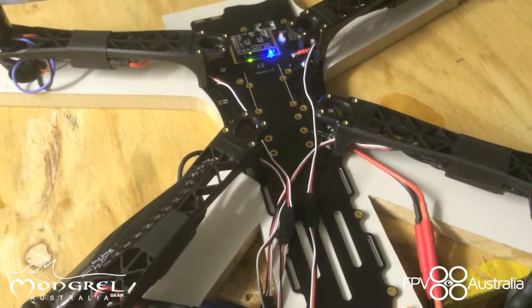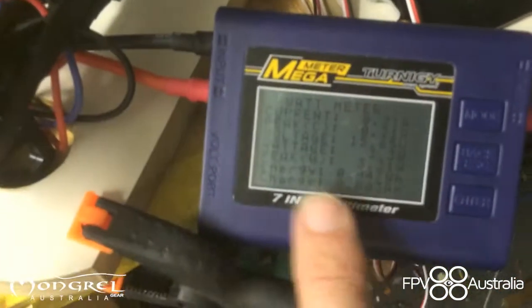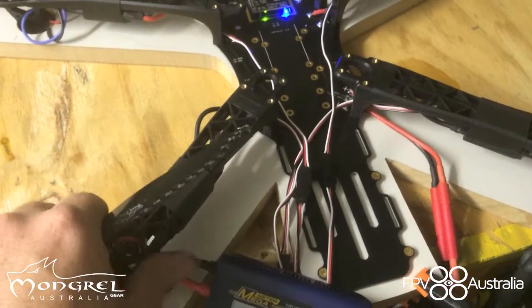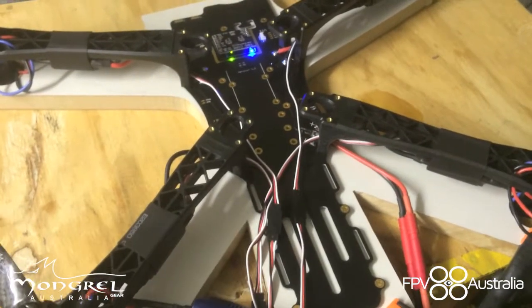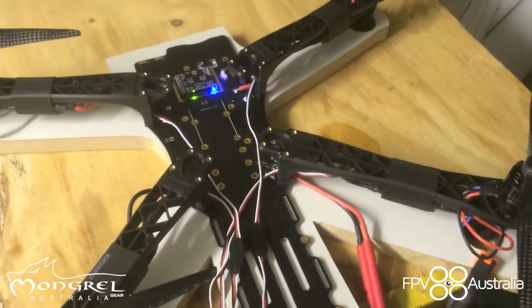Once that's done and we're nearly out of battery power, we will actually give it a few bursts — we get it up over about 50 amps. We've got this little watt meter here that gives us our peak current so we know what we're all doing. But I must stress, if you're going to try this at home, please make sure your copter is strapped down and can't go anywhere, because we are going to get these blades running at a bazillion miles an hour and you don't want to be anywhere near it if the thing takes off. I've got safety goggles on and I'm going to step back from the machine when I do it.